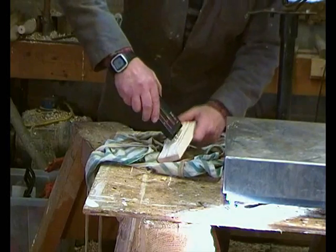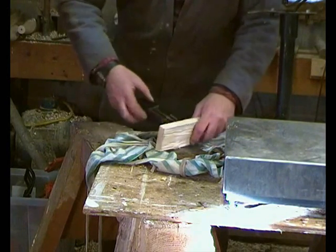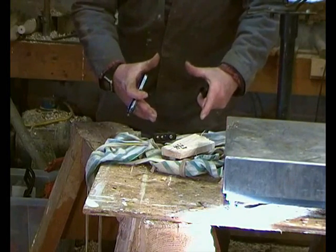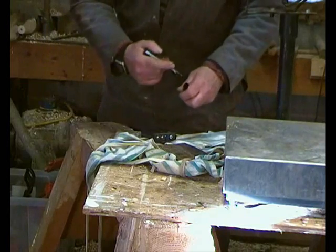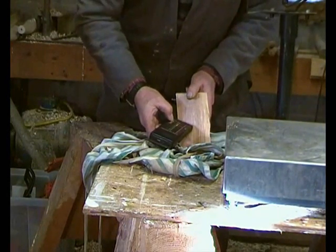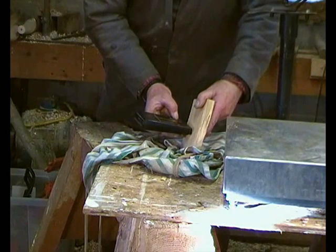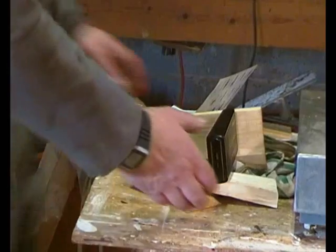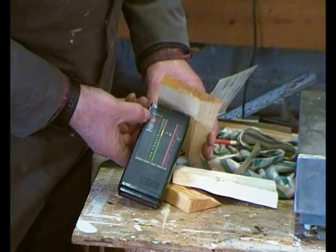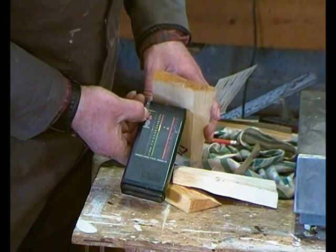The ash is coming out at 60% — that's quite a small damaged piece of ash. I think if it were bigger it would have a lower moisture content. The bit of sweet chestnut that's been laid out in the wet is coming out at about 35%. Here's the moisture meter on the birch — when it gets up to the top of the first scale you press the button and it reads off the second scale, so that's about 70%.